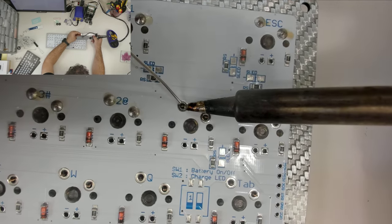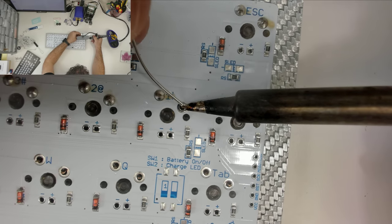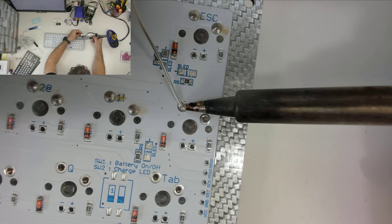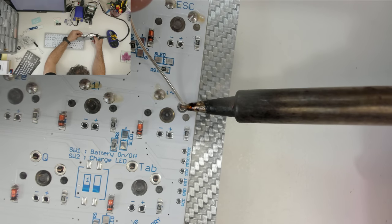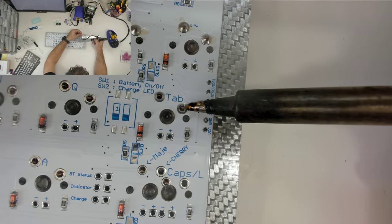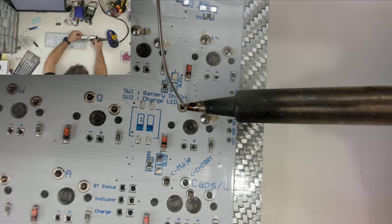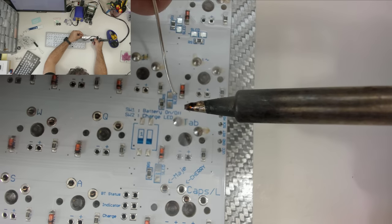And this is beautiful. Some impressive solder work here, if I do say so myself. Now, good solder technique: what you do is you apply the heat to the ring and then pour the solder in around it. You don't touch the iron itself, except to start the well going, but you should be able to paint the solder around the ring.